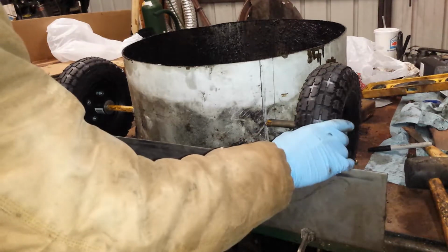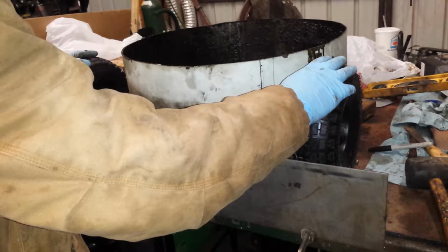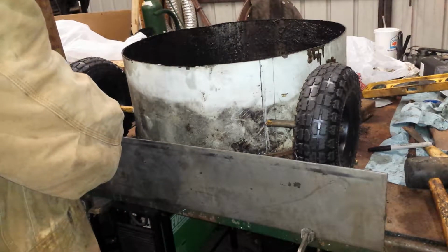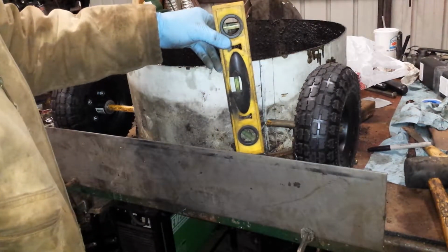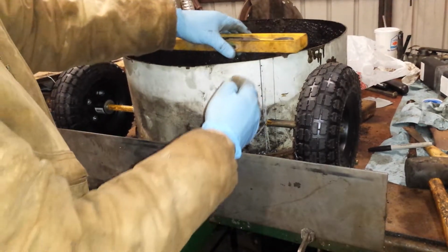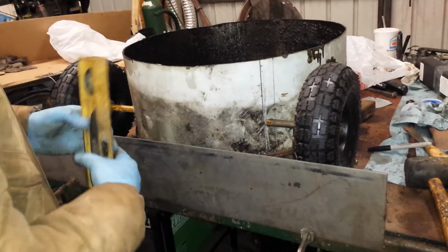So I carried that up. I measured my 2 inch off on the barrel, held my tires, and I kind of had my square off the table, off the bearings, and marked the top, and I had my level as a straight edge, and I did my marks. Nothing too fancy. I just leveled down with this guy, and then put my 4-foot level across again, and set over 5/8 of an inch. I didn't go to 3/4 because I want that pretty tight. I don't want that weld to leak.